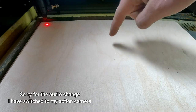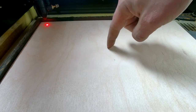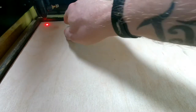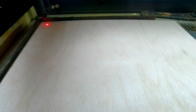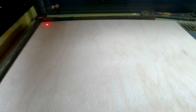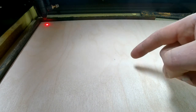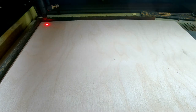So we're over at the laser and as you can see there's a tiny little bit of flex — not too bad, the MDF I use is probably quite similar. It maybe goes up a millimeter so it's not going to make too much difference, especially not in the area where I'm going to be engraving, which is just in that top corner there. I have this focused into the top of the board for engraving, which should be fine for cutting as well because you've got enough tolerance.